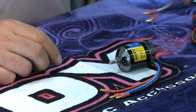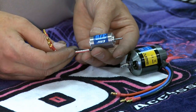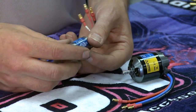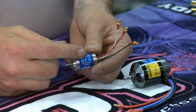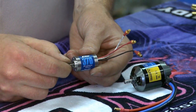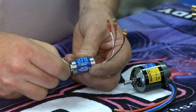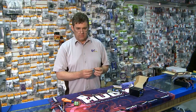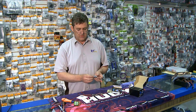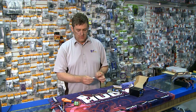This is an inrunner style motor. This is a lot like the common brushed motor in look, but not in design. The windings are on the outside of the can, and the magnet is the armature that sits in the middle. This is a small style for an aircraft that goes into a gearbox. Larger ones like this would go into RC cars — same similar situation. You have a shaft, put your pinion gear on, and everything else.